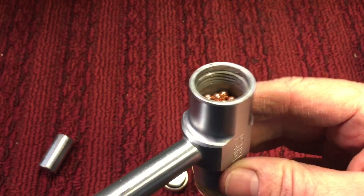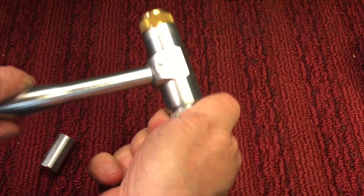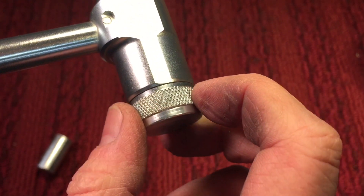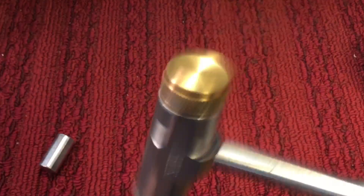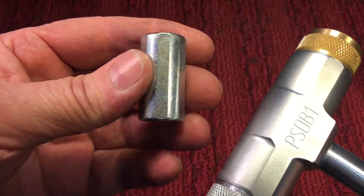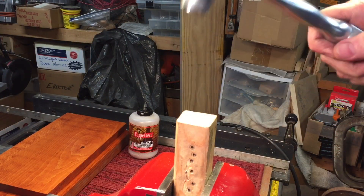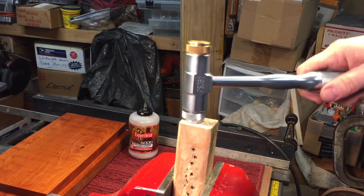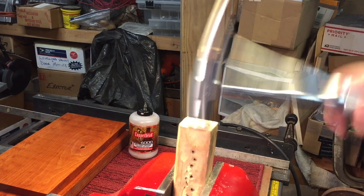You can see I filled the head of the hammer just below the threads and I'm going to screw on the steel tip now. When you screw these tips on, you want them very tight — you want the tip to make contact with the surface of the hammer. You do not want the threads taking the brunt of the hammering. Tighten them down good and tight, and now it's practically silent — you don't hear that clunking going back and forth. Now we have the BBs installed, and you don't have any clunking sound from the slug. But you still have the non-bounce — it's not bouncing back.